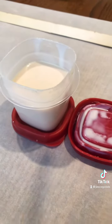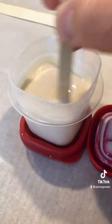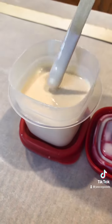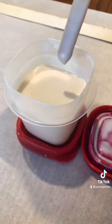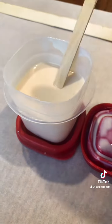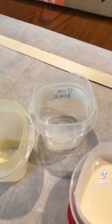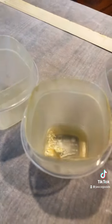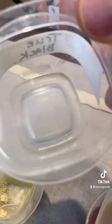The next tip is I buy these little containers from Walmart — I think they're only a couple bucks. I use them to put the clear coat in because the water-based clear coat dries so fast that it becomes gummy around the edges of the can. You don't want that on your can because it falls inside and sticks to the brush when you're wiping it.